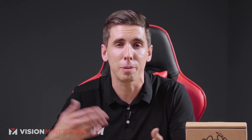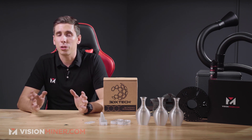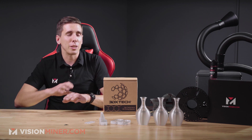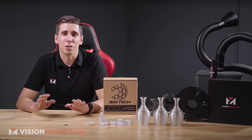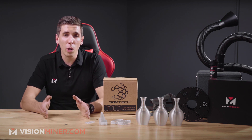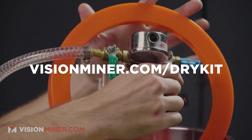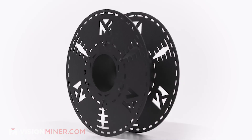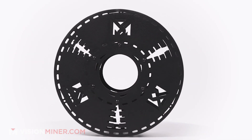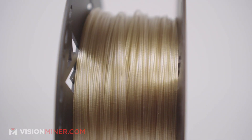You absolutely have to dry this filament before you print it or process it, because it is hygroscopic — it absorbs moisture out of the air. And if any of that moisture is in the filament when you're melting it, you get little steam bubbles and your surface finish is totally off and mechanical properties go down. If you really want to dry your filament well, we've got an entire kit available on our site with vacuum chambers and ovens. We also have metal spools, so if you want to dry at higher temperatures faster without melting the spool it came on, you can do that.